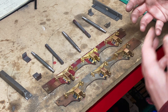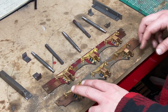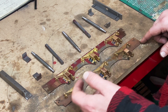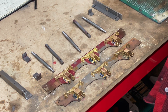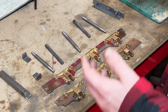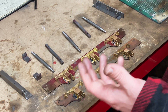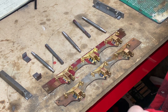At this point I need to figure out what to do next. There are two choices: the first is to rivet these onto the tender frames, including the little hooks at the bottom that stop things getting caught under the wheels. Alternatively, I need to fix these angles into the beams — I've squared them up and I'll double-check the squareness again. I think I'm going to rivet them, but alternatively I could try brazing them. I'd really appreciate any advice or comments about that — please let me know in the comments.